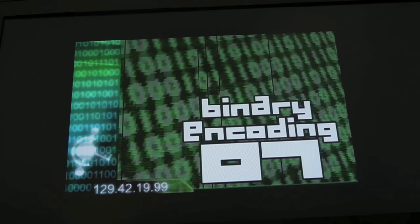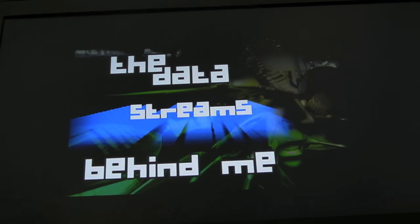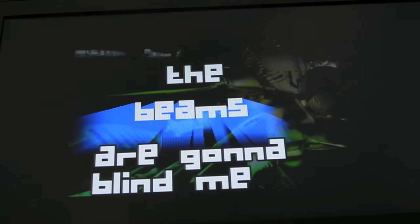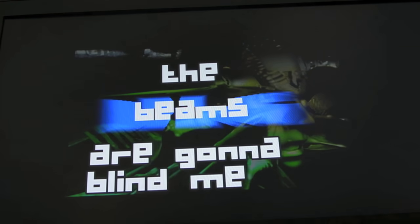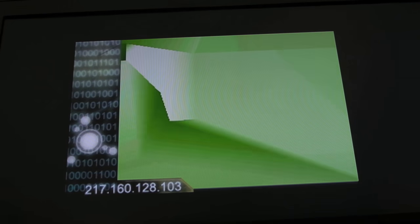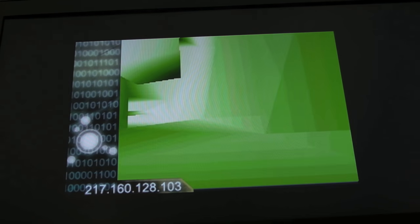If you remember when the scene changes in a minute and you get four different lots of text — this is where it was freezing. Yeah, absolutely rock solid. The other interesting thing: I did some testing off camera in 030 mode when I started hitting that problem, and I got the same problems just using the standard 030. So that's part of the original clock problem that went with the Falcon. I'm not sure who originally worked that out — I think it might have been Rudolf, the person who originally worked on the CT60.